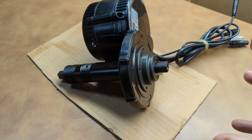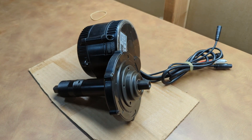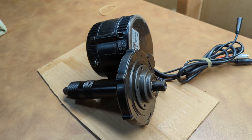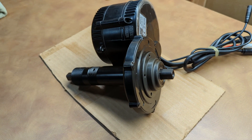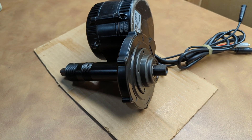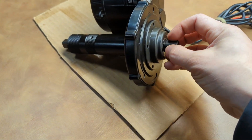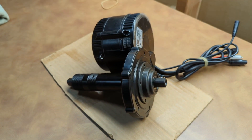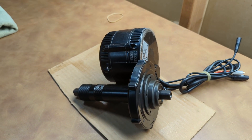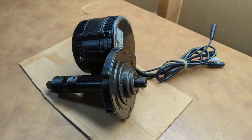This is something you don't really want to do with a soft blow hammer or a piece of wood — everything needs to go in straight. The steel materials on these bearings are not ultra high strength, so they're a little softer and you could damage them if you're not pushing them in with a controlled motion. If you have a really wide vise you could manage it, otherwise you want a hydraulic press with passthroughs to allow the axle lengths to push through. We are conveniently located next to a tool and die company, so we gave it to them and they set everything up for us.